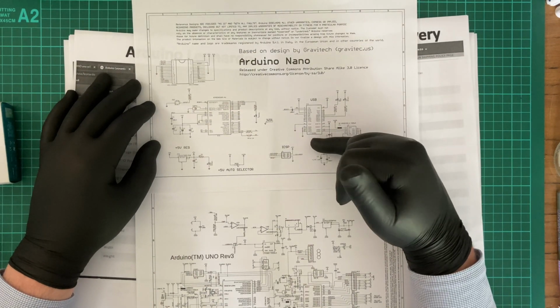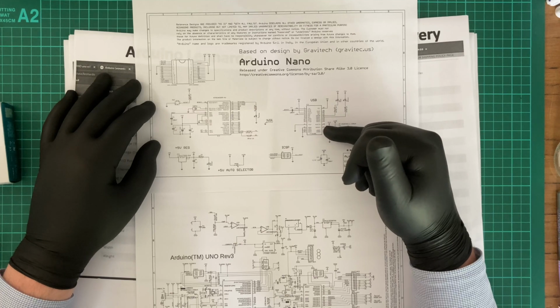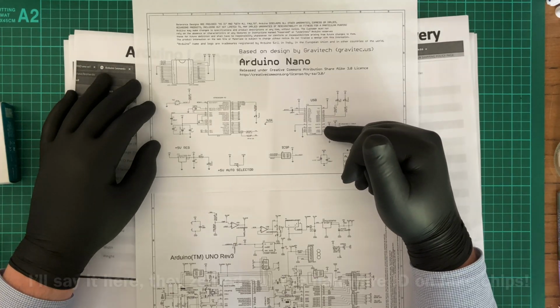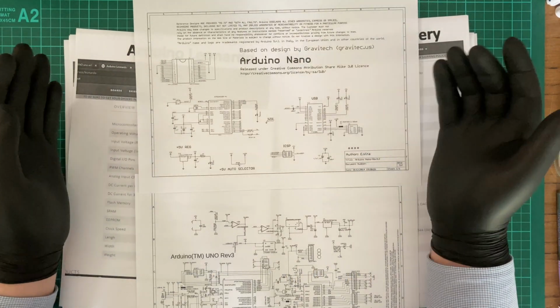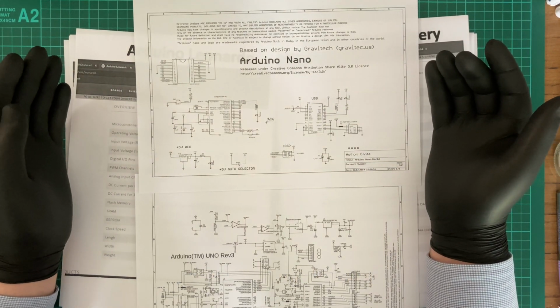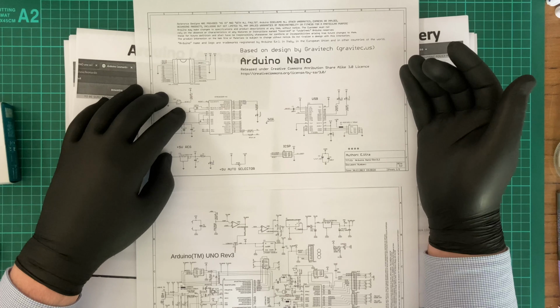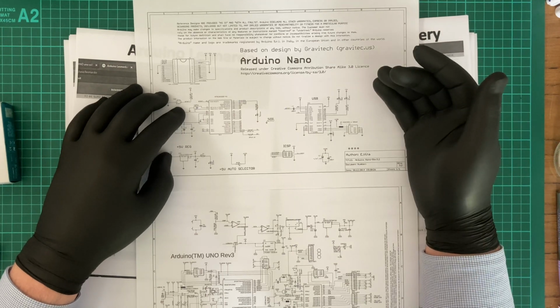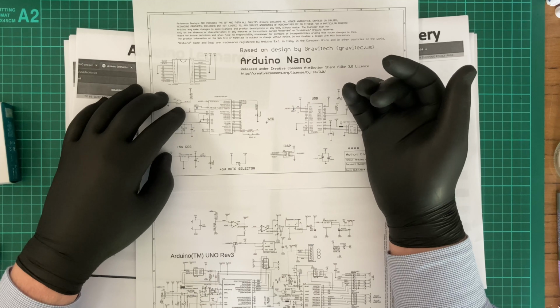And this one, here we go, that's the FTDI chip. I'm so glad they stopped using this after the fiasco this company caused. It just, my jaw dropped. But really, other than filtering the power properly, there's an optional reset switch if absolutely necessary. It's probably necessary during development, but while it's running, power cycling the thing should solve it. The LED isn't exactly necessary.